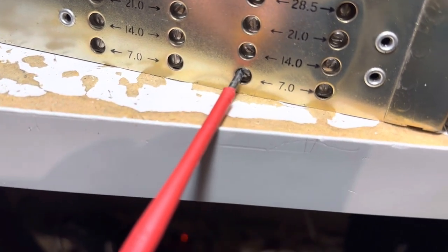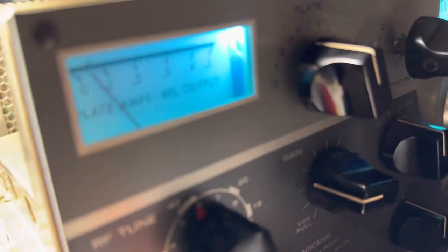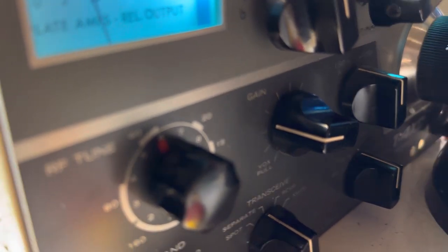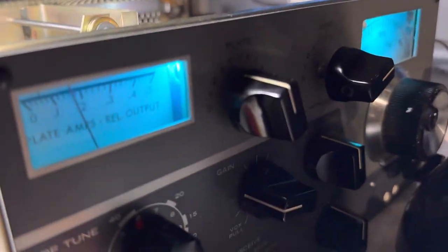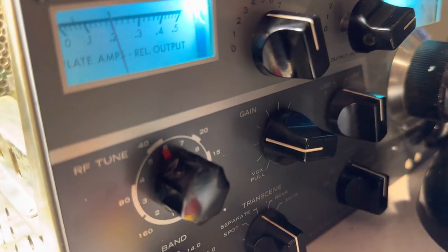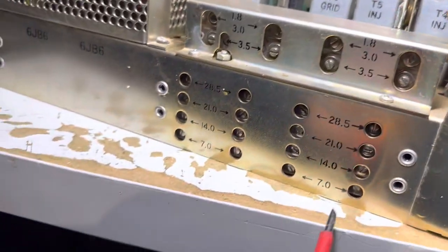You might go through these a few times and peak them because they interact a little bit — not a whole lot, but a little bit. Look at that — that one was promising too. Both of those were off a good bit on 40. Take the gain down a bit. So 40 meters I think is going to have some power now. You want 40 to have power — it's probably your most useful band, day and night.